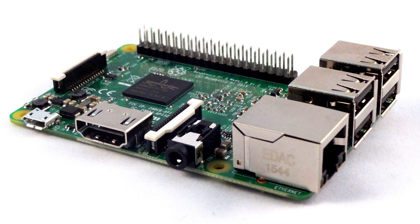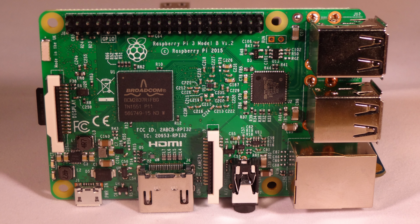Let's take a closer look at the Raspberry Pi. This is the Raspberry Pi 3, the third iteration from the Raspberry Pi Foundation. It's designed in the UK and mostly manufactured in China. It has had siblings — the Raspberry Pi 1 and 2 — which sold millions of units, making it one of the most popular single board computers. In the center of the board you can see the Broadcom BCM2837 chip, that's the system-on-chip that powers the whole Raspberry Pi. It's a 64-bit chip.